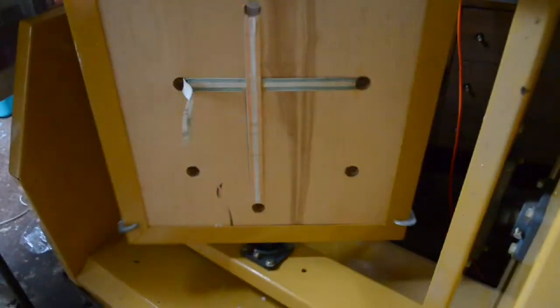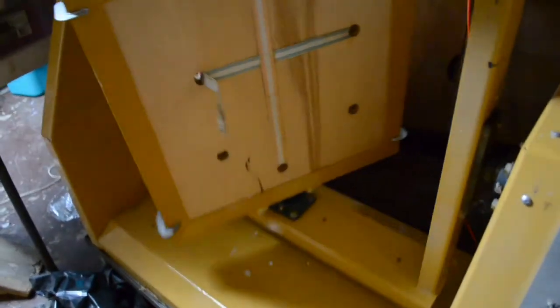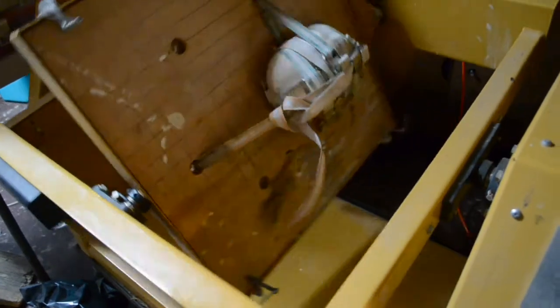And this will be a hollow casting, so it will get everywhere. I considered making another solid casting. The problem with that was not being able to turn the mold over to coat the top of the crown of the skull and the top of the nasal bones caused a couple of minor air pockets in the second casting. Now, that wasn't so much a problem. They were repaired, they were filled in. But I thought, you know what, just for the heck of it, let me go ahead, fill it with 6 ounces of resin and do a rotational casting. The mold is holding together beautifully.